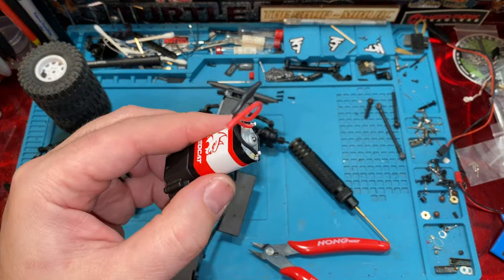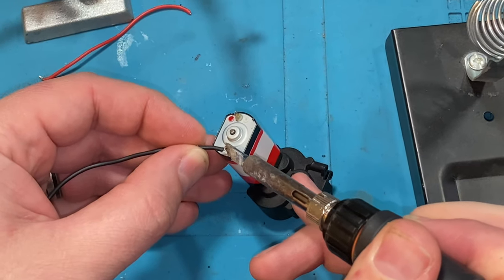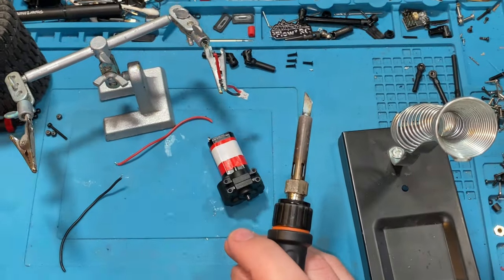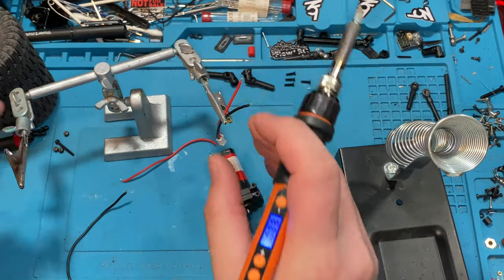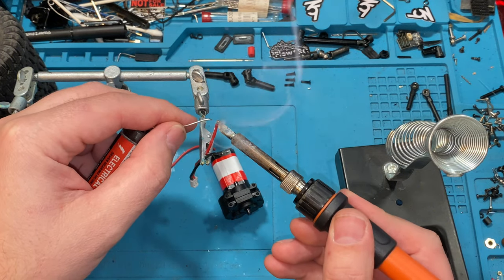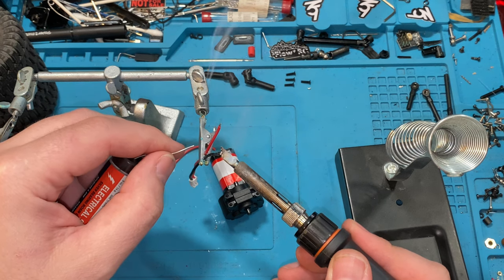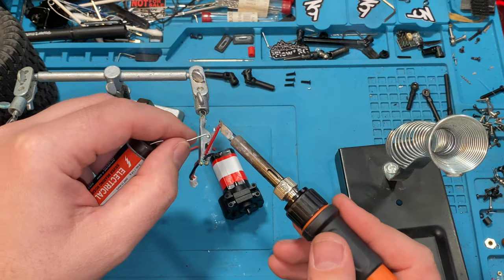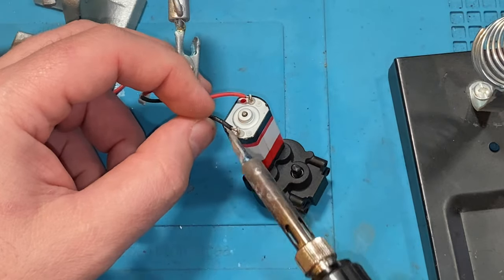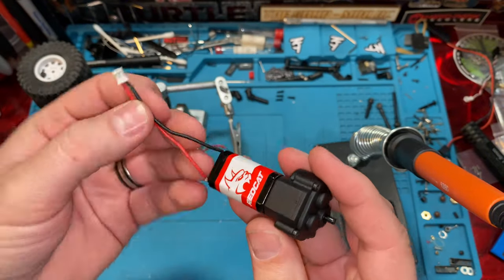This will be a super easy little changeover. Easy to remember, red's got this little red dot right there, so super simple. We need to tin our wires that we cut. So basically you're gonna heat your wire up, and then your solder will go right to it. Really, you should be trying to put the solder on the wire, not on your soldering iron, but whatever, it's gonna work here just fine. And just like that, easy peasy lemon squeezy, guys. It'll be a lot cleaner,